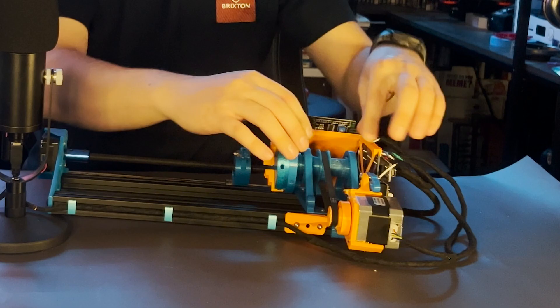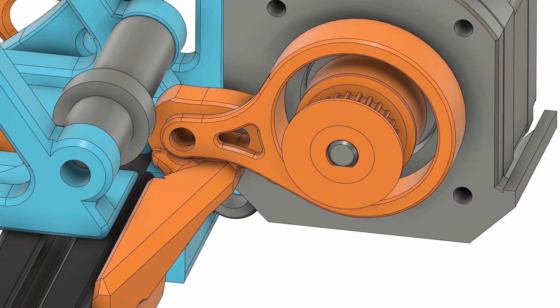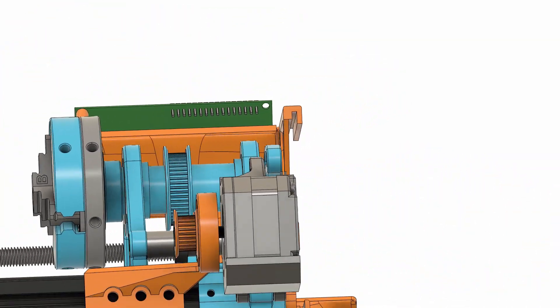The main head rides on two bearings inside the A-frames, which keeps things centered and lined up on the main shaft. The belt is tensioned via two swivel points — one at the bottom — and tension is held via the bolts attached to the NEMA motor and the bolt attached to the pulley. This allows me to keep the stepper in a square alignment so I don't have an angled belt eating one side of a pulley, or uneven tension leading to jumping of steps.